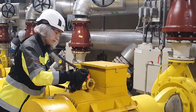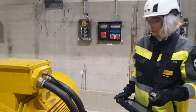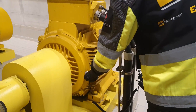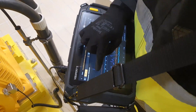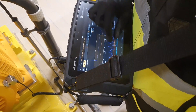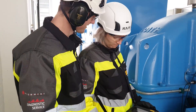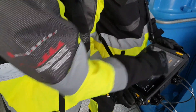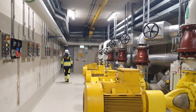Next, analyze the data. The interface simplifies this complex process — it displays all necessary information on its large screen, guiding you through the analysis. Then, you can look for imbalances in the vibration data across all measurement points. Once you've identified the imbalance, the next step is correction. Based on the data, adjust or add balancing weights as necessary. The Vibexpert 3 balancer assists in calculating the precise location and weight required.